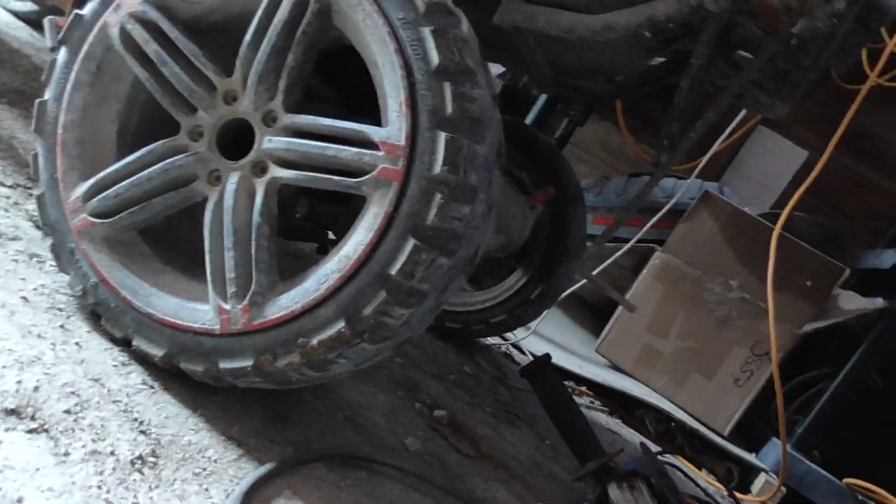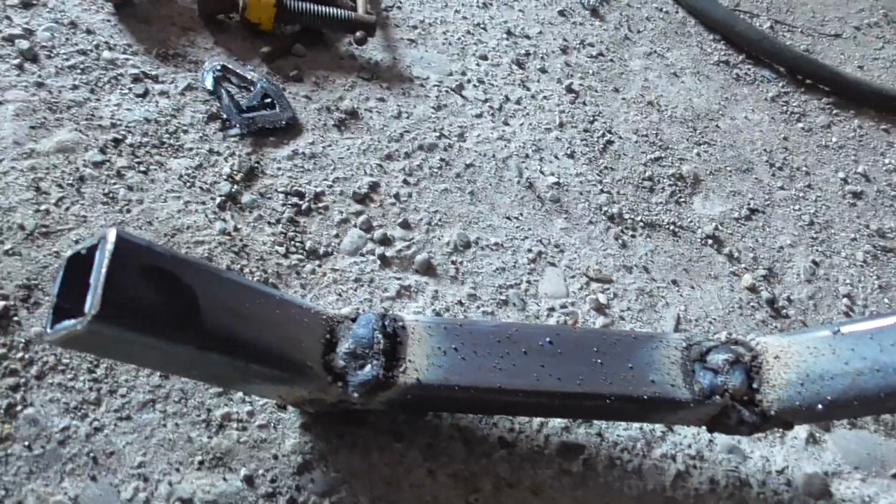Oh, yeah. These holes. Remember the gaps that were there? They were a little more difficult to fill up than I thought. Because if I concentrated on one spot, I was actually making the hole bigger, so I just quickly went around it. Give the first part a chance to cool off before I get back around to it. And that seemed to be what did it. I just kept going in a circle until the hole got smaller and smaller.